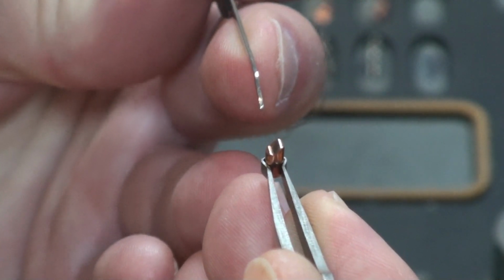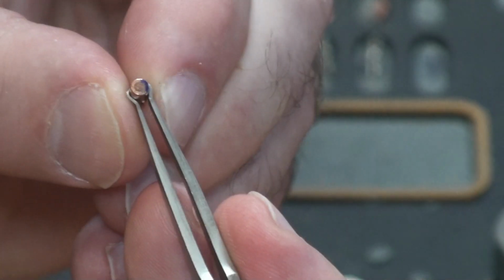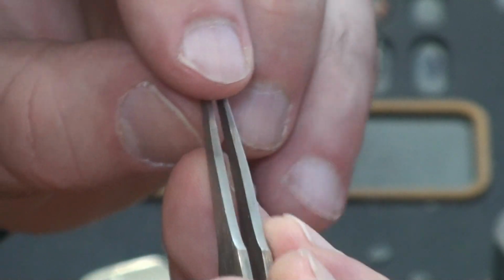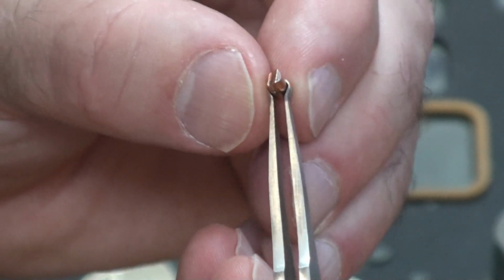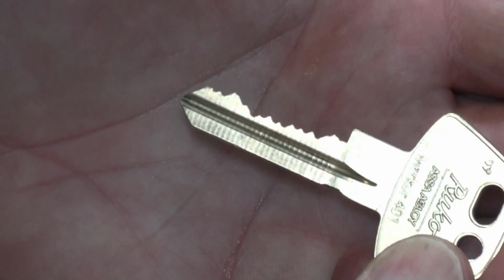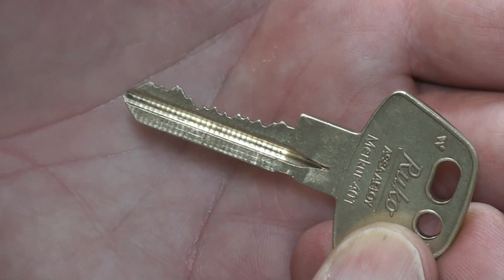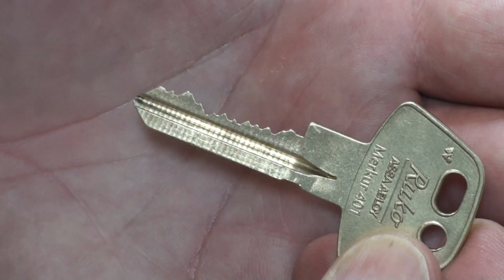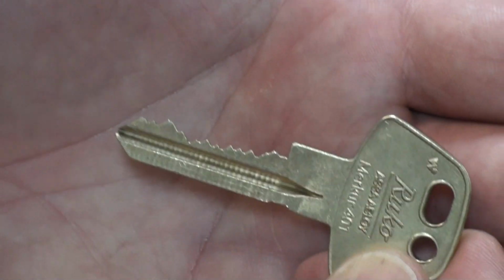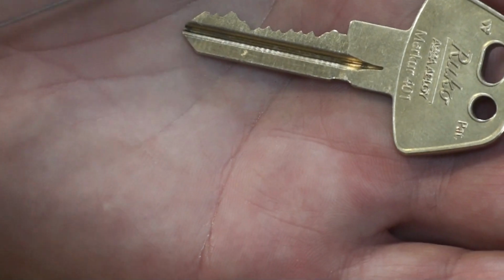So you can see that we've got a round pin at the top, so that's just the standard configuration, okay? But down at the bottom, the business end where the key goes, there are those 2 levels, 2 little peaks, and that's where the 12 comes from in D12. So you can see that the key in fact has got 12 cuts to it, so not just 6. Okay, so there are 6 pins, but each pin has 2 peaks, so we in fact have 12 little cuts